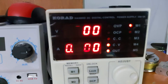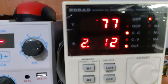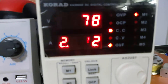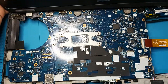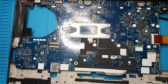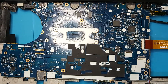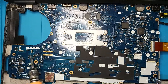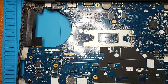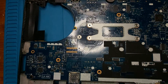You can see the voltage drops down to 1.7 volts, confirming the short. Let's check the motherboard — in most cases it's a capacitor. I'm going to check the areas with capacitors: this one here, this area, this one here, and also this one here near the main power section.